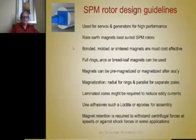So at some point it's cheaper to use the hole out of the stator punching and punch a core out of that, and you can add a lot of features. You can add cooling features. You can add dovetails or magnet retainment, locating features. There's all kinds of things you can get for free from that.